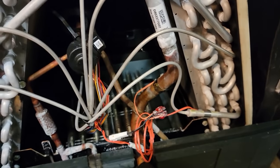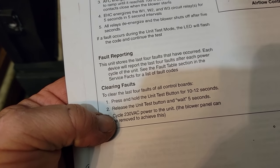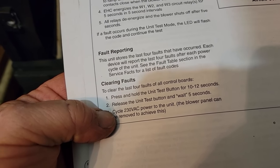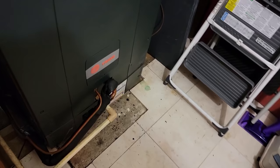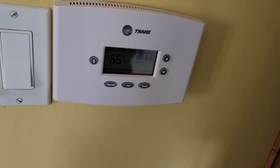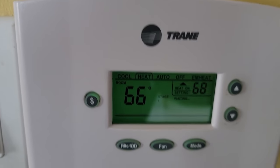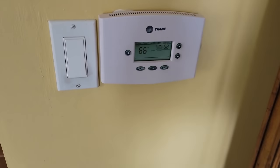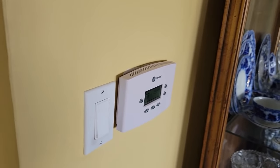Let's get this thing insulated and kick it on and see what kind of heat we get. To erase and clear the faults for a fresh start, press the test button for 10 to 12 seconds, release it, wait five seconds, then cycle the power. Back on regular heat - it's interesting, I don't hear the fan running but I can hear the condenser running and I can see the fan turning. The thermostat says 'waiting' on first stage. The suction line hot gas is not very hot, so we might be low on refrigerant after all.